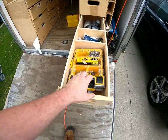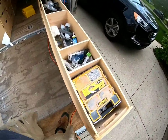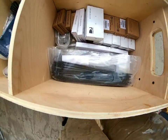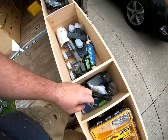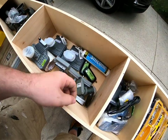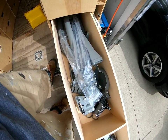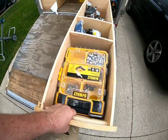Next one is DirecTV. I don't really use this much but it's all in here. Everything's in here except for a receiver to do a DirecTV install. Just my regular small parts - zip ties, splitters, band stop filters, flat cabling, remotes, 21-volt power supply if I need it, extra F connectors, LNBs, some silicone, bishop's tape, different types of LNBs. This is an international LNB - the internationals are the 119. This is my dish supplies. The only thing I actually need to bring is the reflector itself because you can't fit it in here, so I'll throw reflectors in the trailer. I don't need to worry about anything else - it'll all be in the trailer. Obviously a ladder too.